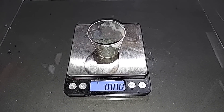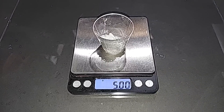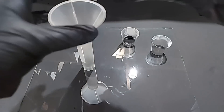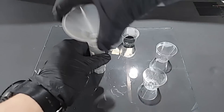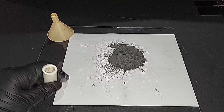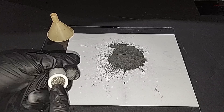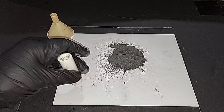Next mix: 18 grams of pure manganese dioxide, 6 grams of battery manganese dioxide, 5 grams of powdered aluminum — same ball-mill mixing process with lead balls. This time, instead of a paper tube I've got PVC, and I'll plug the end with JB Weld mixed with kitty litter, which turns out to be a great plug. I'll fill it from the other end, pack it well, then drill a hole through the whole thing — this will actually become a rocket engine.